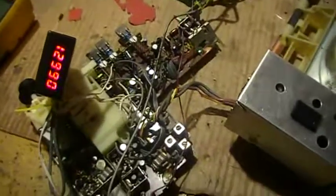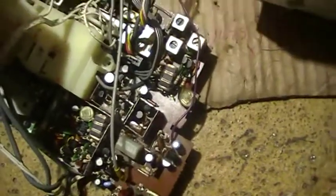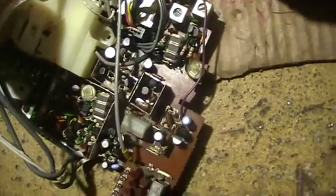Another update on this Sony 6800. I've actually removed and replaced I think 14 transistors in this thing. I've had to remove all the sardine cans as I've explained and track down all the transistors in the synthesizer. I don't normally do block changes, but in this case I'll show you why it was necessary.